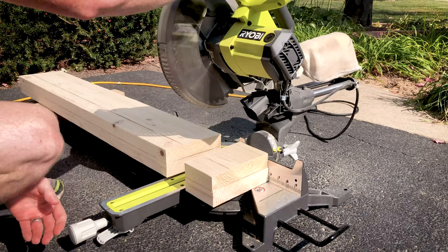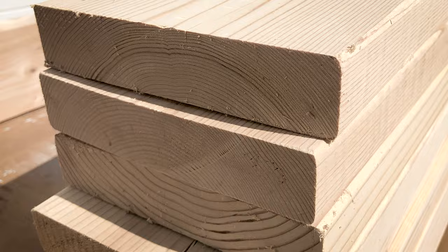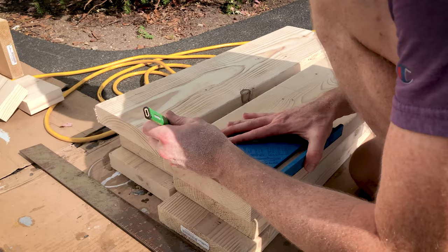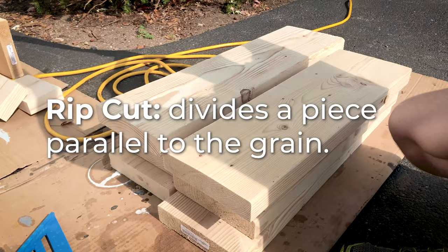Next, we're going to look at the scrap pieces that will make up the plinth. You can see the corners are rounded off on these pine boards. Since I want to make it appear as one large solid piece holding up the tabletop, I need to square off all the corners. So I'm going to measure the pieces to cut them 12 and a half inches long by 7 inches wide, with a rip cut off one side — meaning a cut that runs along the length of the board.